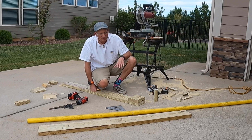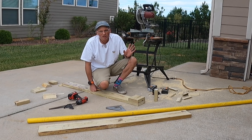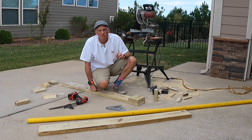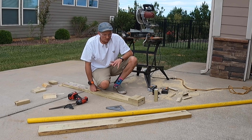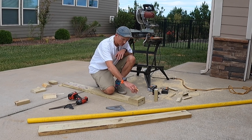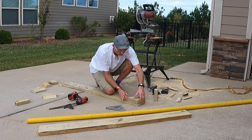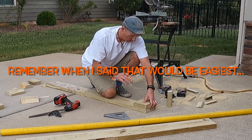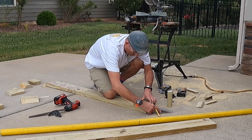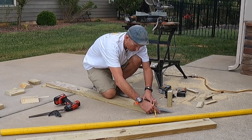Alright, the first idea — I got too cute with the angles and they were too hard to cut with this saw. Then when I went to assemble the first pair, I didn't pre-drill the holes and I split the wood. It was just too complex for someone using simple tools. So going with a new plan: instead of six-inch pieces, I'm going to make them out of square pieces, all 45-degree angles, with a base on the bottom. Hopefully I can show it better than I can explain it.